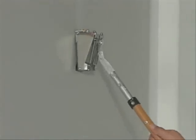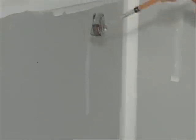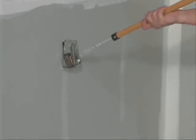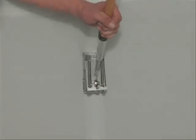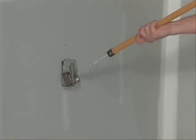Begin the topping coat with the nail spotter. By doing this first, you can cover an entire row of nails with each pass without having to interrupt for freshly finished joints. If you need 3 coats of compound over the nail heads, you should apply the first coat before you begin taping with the taper.